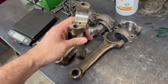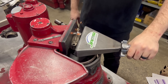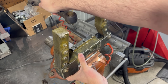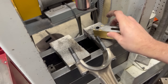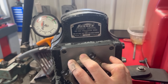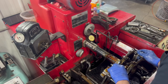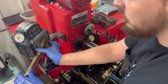With the crankshaft modification wrapped up, we have just a few machining operations to wrap up the bottom end of this engine. Our customer provided us with a set of ARP bolts for the connecting rods, so we resized the big end of the rods by first cutting a small amount of material off of the mating surfaces of the rods and caps. At this point we realized that the connecting rods had become slightly magnetic, so we demagnetized them by passing them through the electromagnetic field created by our magnetic yoke. The new rod bolts were carefully pressed into the connecting rods, and the caps were torqued to the provided spec from ARP. We can see that the big end housing bore is reading at 3 thousandths of an inch tight relative to the lower side of the diameter tolerance. We used the rod hone with a roughing stone to quickly remove material from the bore, bringing us to within a thousandth of our final size, then switched over to a finer grit finished stone, and carefully honed the connecting rods until we were just within the tight side of the tolerance provided by the connecting rod bearing manufacturer.